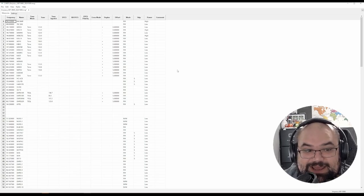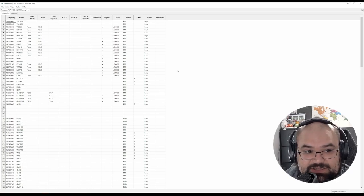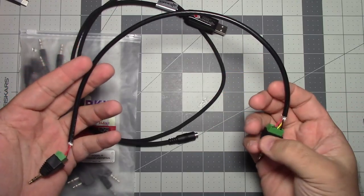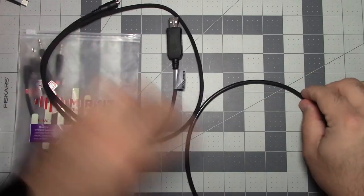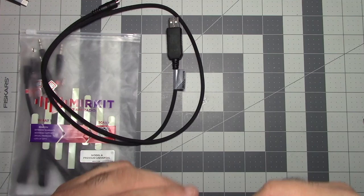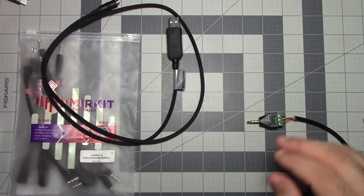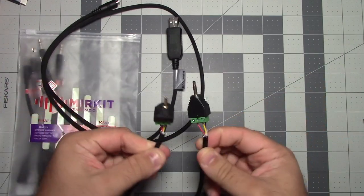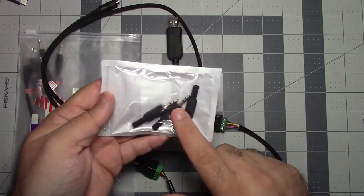I bet this means I can make my own cable for my Yaesu VX7 just like I did before — and would you look at that, it works perfectly. This is a cleaner solution — to have this jack here and then swap adapters in and out, rather than what I did last time with my Yaesu VX7 using that Y-splitter setup. These are prototyping ends, so I could actually just make a cable using some ends like this — I'll put links to these down below.